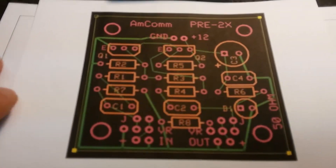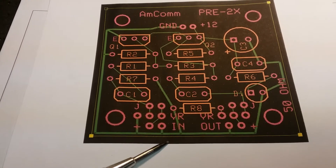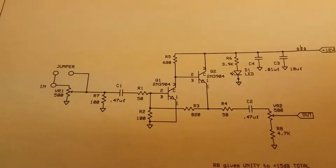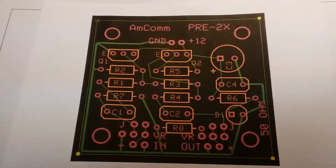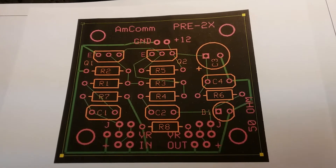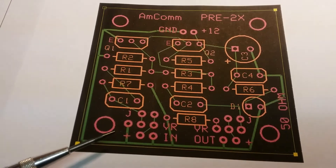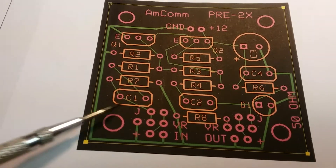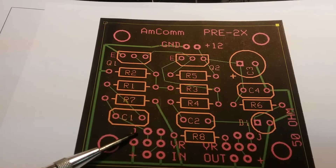If you want to lay out a board, here's the layout — this is a 4-to-1 scale drawing. The board is actually about an inch and a half square. There are the components marked by their RC and Q numbers. It's a pretty simple board with no oscillation problems. What I've provided here on the input and output is the ability to wire it with a pot on the input and three connections for the output pot. Or, if you don't want to use a pot wired directly to the board and prefer it external, just put a jumper in where the J is and come in and out over here.